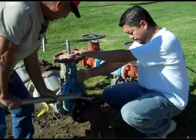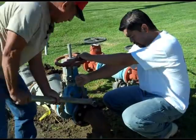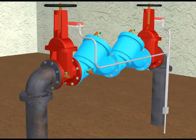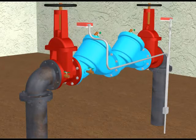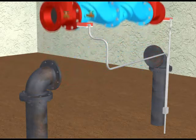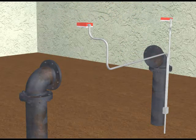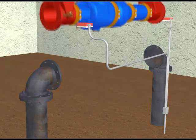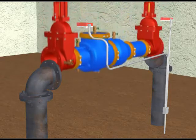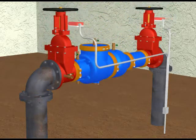There are many issues and additional costs you face when you replace an existing backflow. For example, if shutoffs are outside stem and yoke and use tamper switches, installation often requires coordination with alarm companies or electrical contractors to rewire switches. With the Wilkins 300AR, you can simply remount to new outside stem and yoke shutoffs, and there are no issues or costs associated with dealing with alarm companies or electrical contractors.